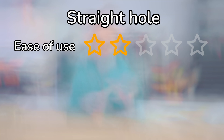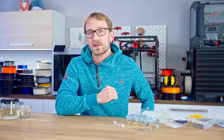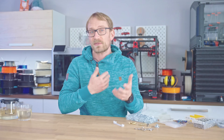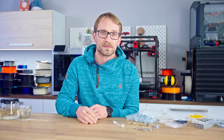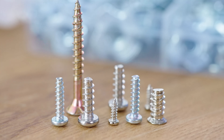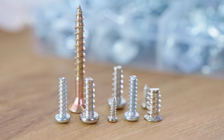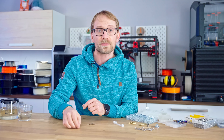If you get it perfect, this sort of connection can be pretty strong, but in practice it's a coin toss every single time, and because it's not repeatable, it also gets two stars for strength and reliability. Would not recommend. Now, a quick note about using coarser thread screws made for plastic or wood screws — in my opinion, those are actually not a great fit for 3D prints.